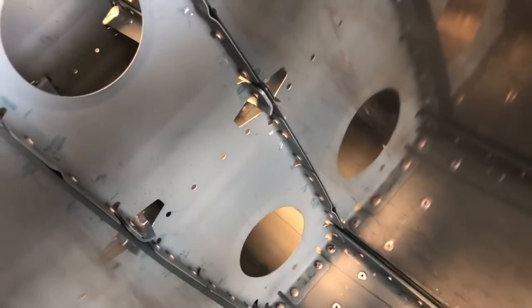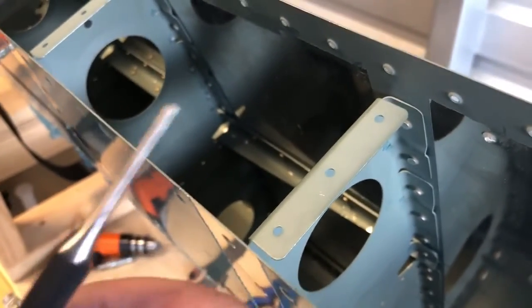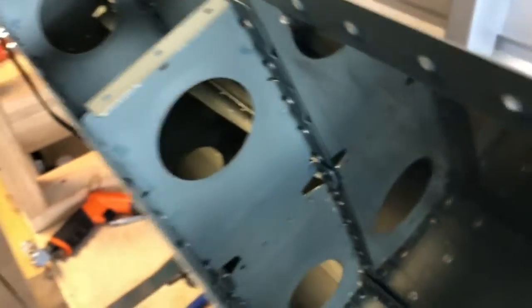Don't be surprised if you have difficulty getting the tines and the rivets lined up - you're just gonna have to work with it. Use the punch I showed you. If you have a smaller punch it would be better; you can come in from the inside this way and then follow it back out with your rivet. Other than that, that's about it.